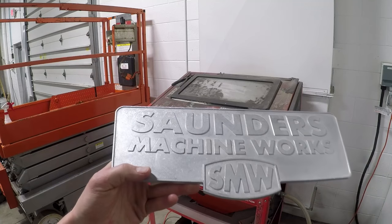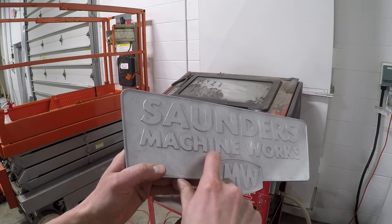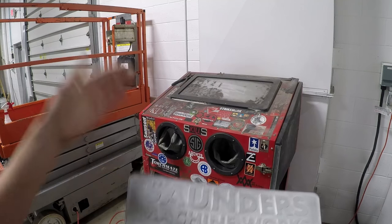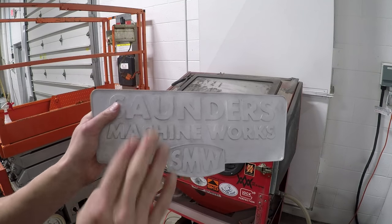The other thing is, the key to good powder coating is not having debris and junk and residual grease and grit and grime in these little sharp corners. So ironically, I'm going to put it back in the blast cabinet to clean it up. Then I'm going to wash it with soap and water. Then we're going to powder coat.